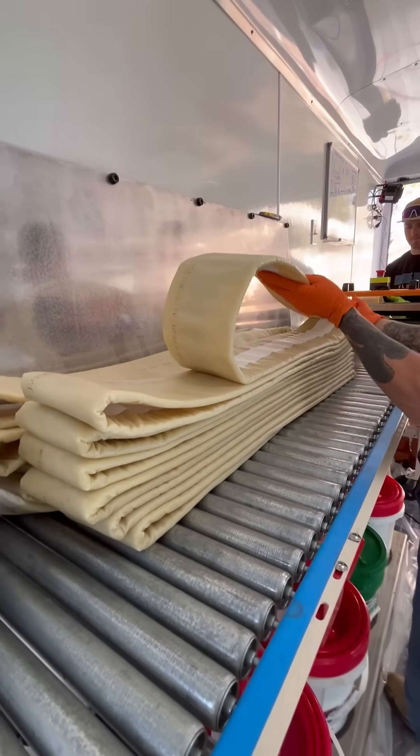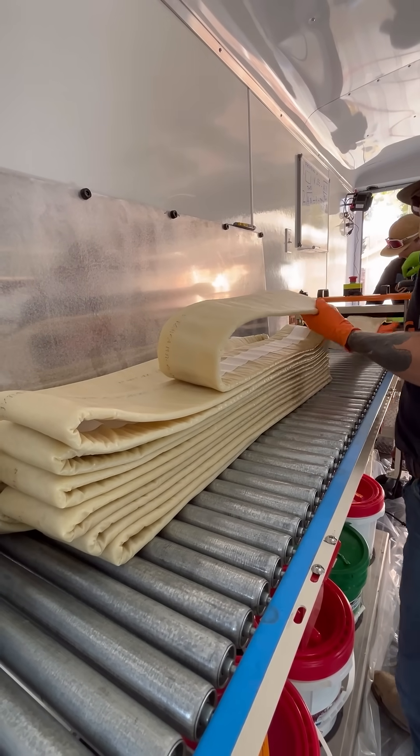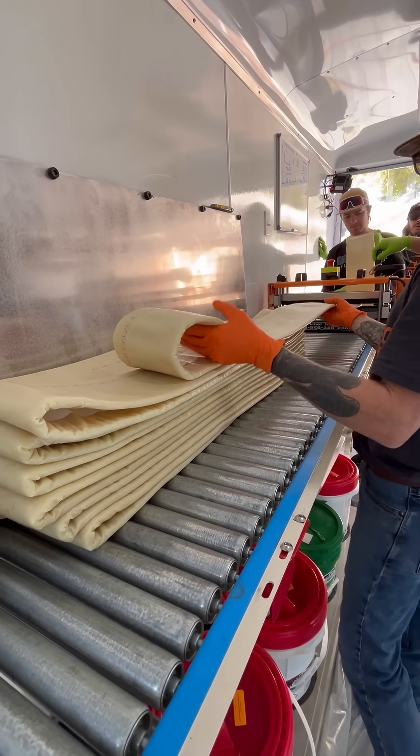Some of these roots could have been avoided with a liner, and that's what we're prepping right here. This is basically a sock with resin that we're going to shoot through the line and give them a whole new sewer line without having to dig.